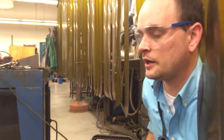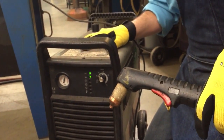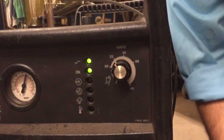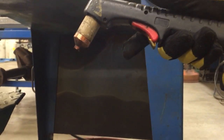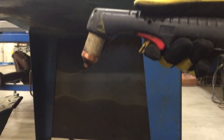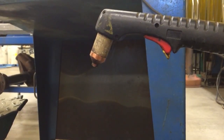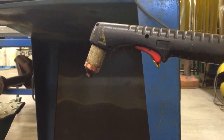The material thickness I'm cutting is pretty thin compared to what this machine can actually cut — I have no problem cutting half-inch plate steel with this. Right now we're cutting about 12 gauge, so I've set this to 25 amps and it cuts just fine. If we flip the safety lever up and squeeze the red trigger, watch the fire come out. You'll notice that hissing sound — that's just air going through the torch tip to cool it off, similar to shielding gas on our welders spurting out. That is normal.